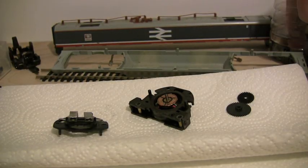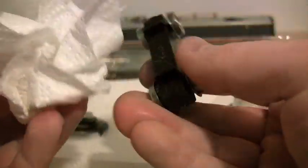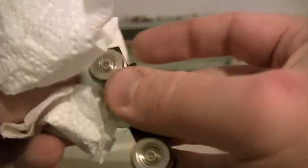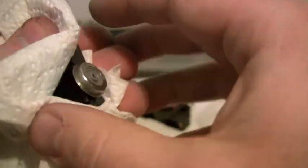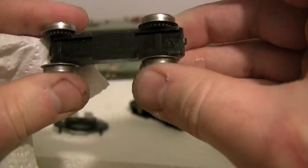Okay, so we're just going to take the pieces out of the rubbing alcohol one by one. So you see here, it's got a pretty big difference between what was put in there. It comes out all shiny and clean. Now just remember when you clean things this way, you do have to re-lubricate them because all the oil that was on them has now come off. So we'll need to re-lubricate them so there's not any problems.